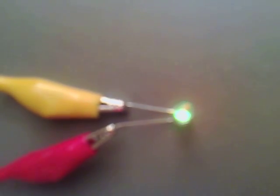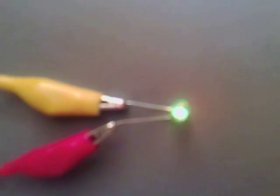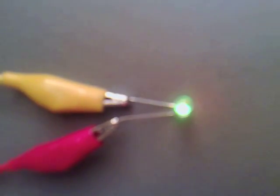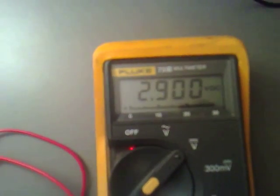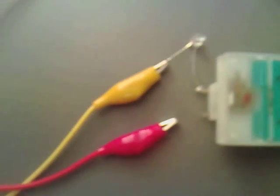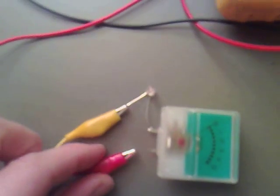Now what I'm going to do is hook up a 100 milliamp meter in series with it, to see what kind of amp draw we're getting. I'm letting the voltage ramp back up to about 2.9-ish. I've got the LED hooked up in series with a little signal meter — zero is basically no amps, and it's got a scale of 1 through 5, with 100 milliamps needed to deflect it to 5. It's sitting at 2.9 now, so let's see what happens when we hook this up.